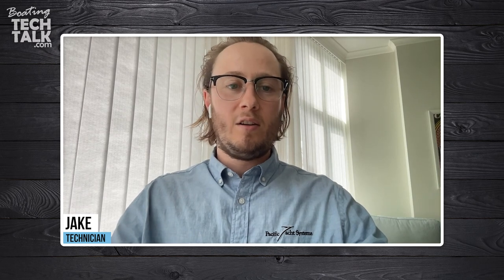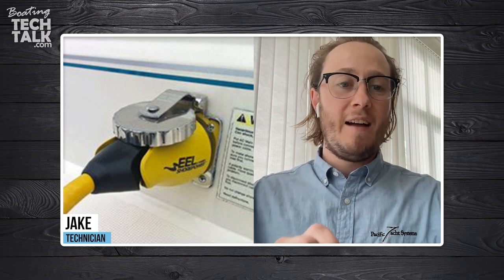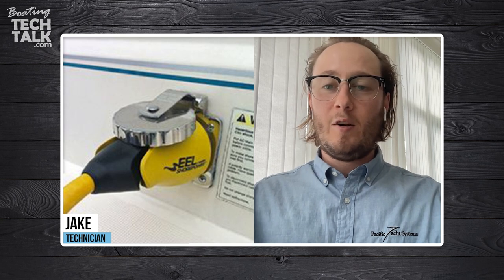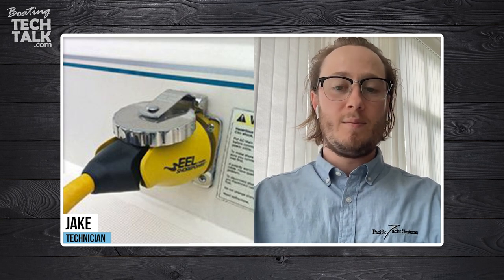What we recommend is, as part of regular maintenance before the season — and especially after the season as well — if you're going to be leaving your boat for weeks at a time during the winter, check that receptacle. Make sure all the pins are clean, check the boat-side receptacle, make sure the pins look good and aren't worn down, and that when you plug in the socket it's got a tight fit with no wiggle room. A little bit of lost contact from a moving cord can also cause scenarios like this.